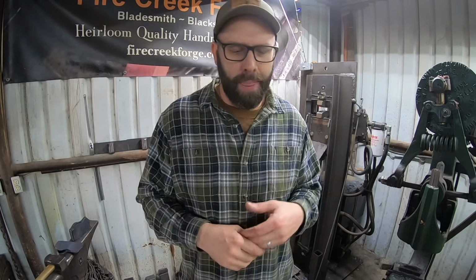But anyway, I could have avoided this if I would have just oil quenched. But I decided to do a little bit of research and development on top of the custom project. Probably not a good idea. I should have just oil quenched it like I've always done before. I've been wanting to experiment with hardening the bit, leaving the rest of it softer for extra toughness, and haven't really developed that yet in my shop.